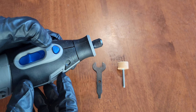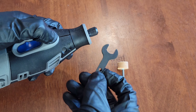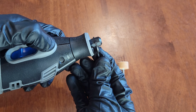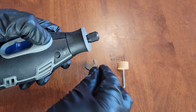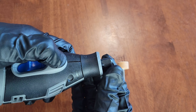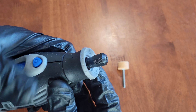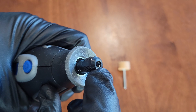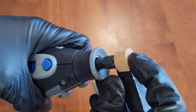For this demonstration I'm going to use the wrench tool. I'll hold down the lock button and use the wrench tool to get a hold of the collet nut, then turn it counterclockwise until it loosens up. Once it's loosened a bit, still holding down the lock button, you can start to loosen it more by hand until the collet inside the collet nut is opened up enough that you can put the accessory in.